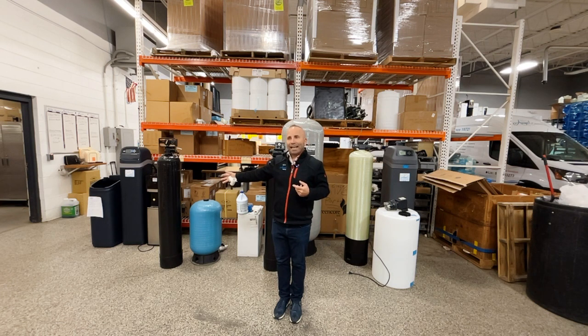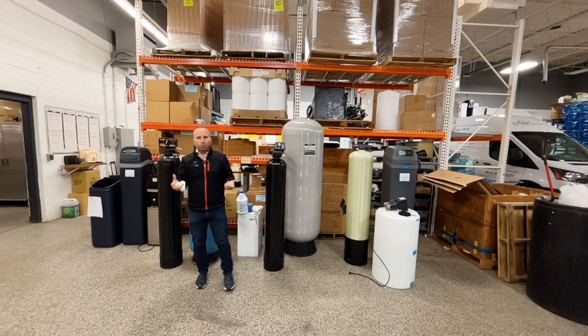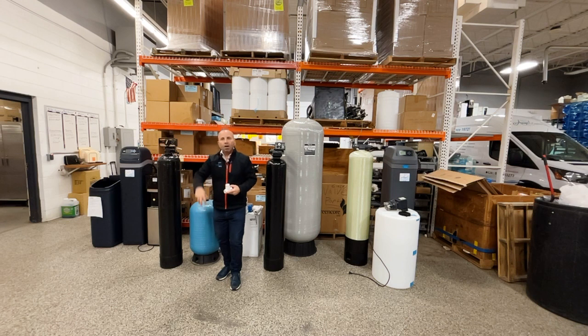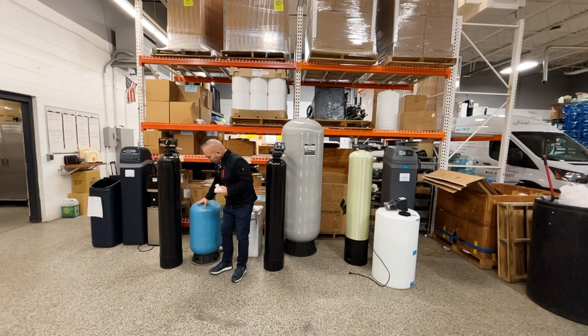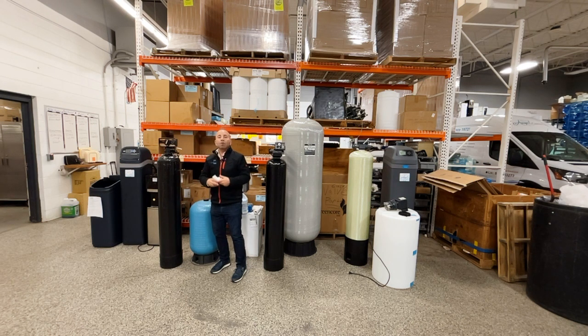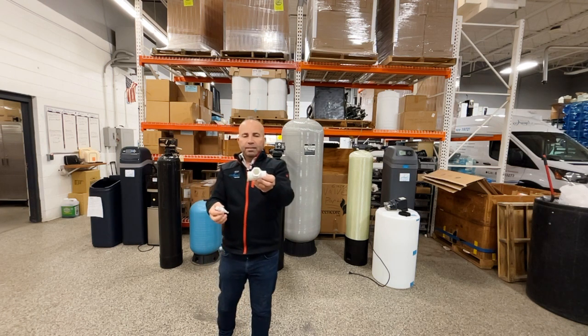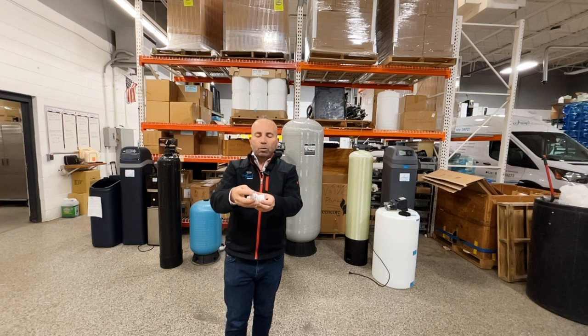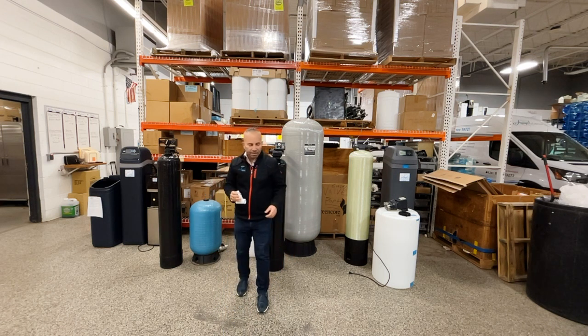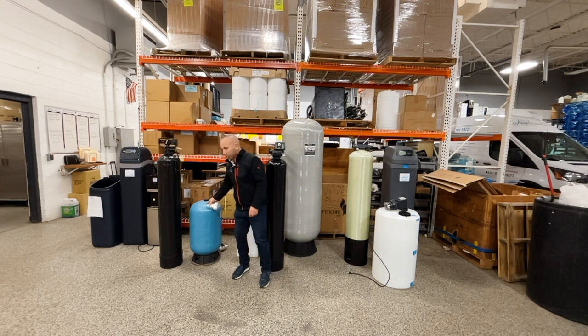First of all, there's the 1980s or 70s style. That's this guy over here. So what we have to remember is that you have a pressure tank. The pressure tank is actually designed to draw the water up out of the earth and bring it into your home. And that's what this guy is. Half of this is air and the bottom half is water. And so on the way into this tank, we used to inject chlorine into a tee like this, and this is an injection point. By the way, we would use a pump system like this to actually draw chlorine out of this tank and push it right into this pressure tank.